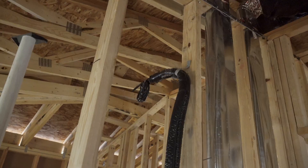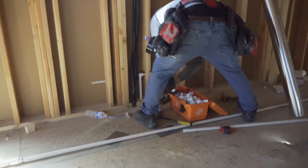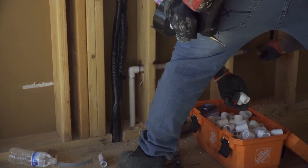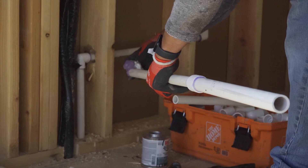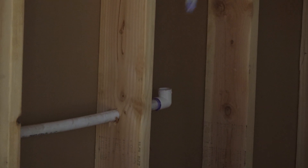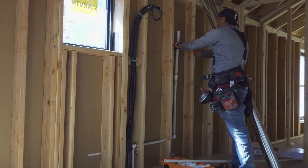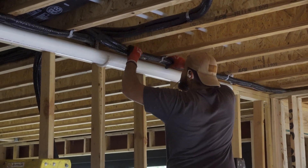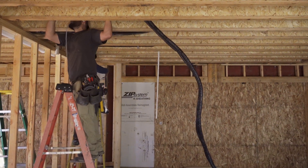You can see they're pulling the lines all the way from the north side of the building, up under where they need to be installed in the bedrooms. These are the north and south bedrooms, going down through the floor. And then this is the penetration for the main living area, where it's going to be installed on the south wall. Here he's working on the drain for the mini split. You'll see in later videos that we actually had to build a soffit here to fit the lines and the drains for the bathroom, just because that interior wall wasn't big enough.